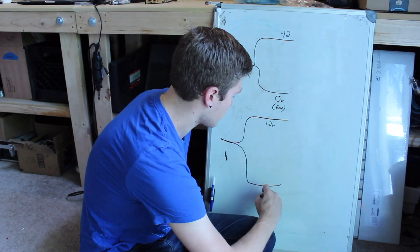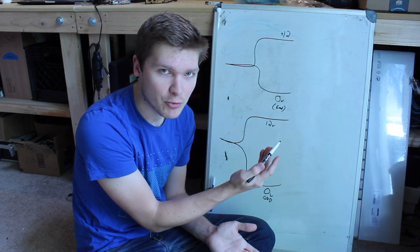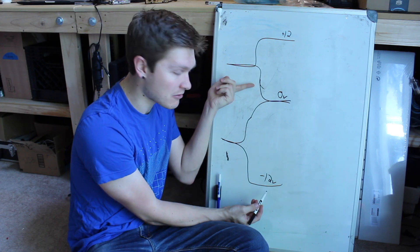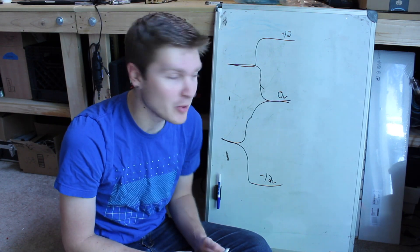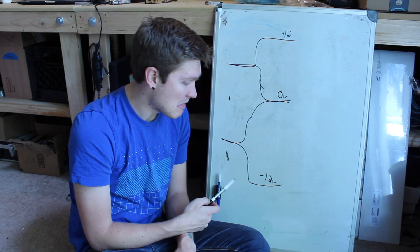So I need to figure out how I'm going to make a power supply that can do all three of those voltages, and I'd love for them to do up to an amp each. So, cool thing about electricity is ground is just what everyone agrees is zero volts, and all a power supply is really doing is adding a voltage differential — it's just saying that ground is going to be 12 volts fewer than the positive pin. So if we have one power supply and another power supply both at 12 volts, and we take the ground from one and connect it to the 12 volts of the other, something pretty cool happens: we're essentially saying that the ground of the second is now negative 12 volts. As long as they're isolated, you're going to be fine and you won't let out the blue smoke. So this is how we're going to get our positive and our negative 12 volts — take two 12-volt power supplies, connect ground from one to the positive 12 of another, and call this negative 12.